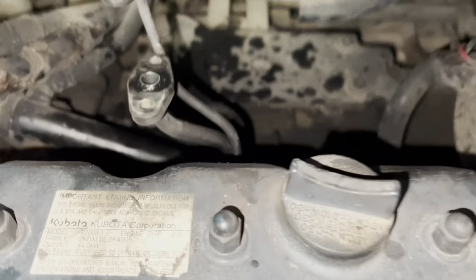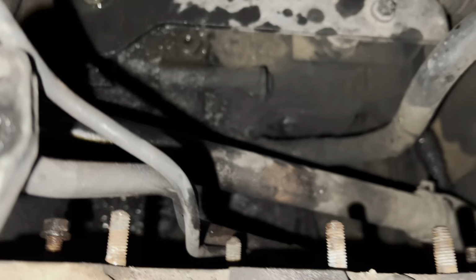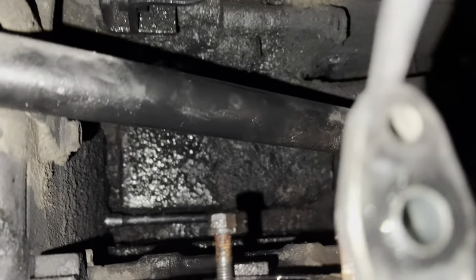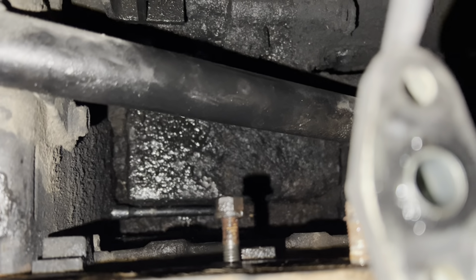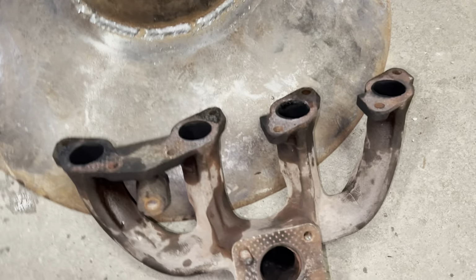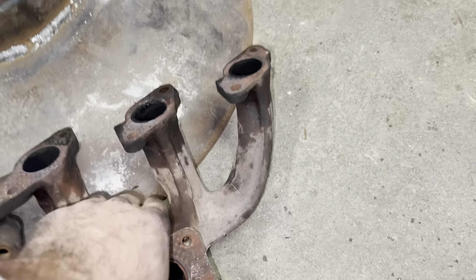start welding. All right guys, you guys can see manifold's out. I actually had a couple of these studs pull out on me. The two on number 1 cylinder, and on the number 2 cylinder, that lower one in the back, but it's out, it's here on the ground. It is definitely cracked, so good thing I pulled it out. You guys can see that there.